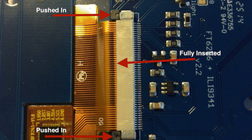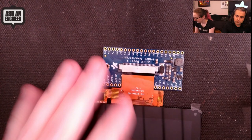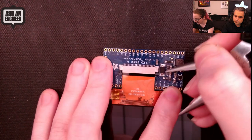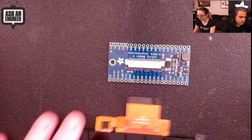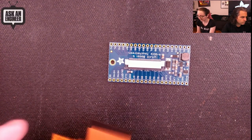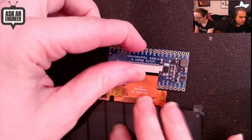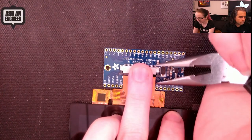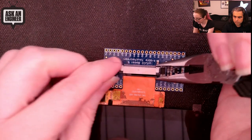Let's go to the overhead — here I've got a nice square TFT display and a little breakout board with that same FPC connector. It's a slide-out style. You can see these little ears — I pull on them and then I can remove the FPC and see the FPC contacts. There's top contact and bottom contact. To insert it you have to squeeze both ears.